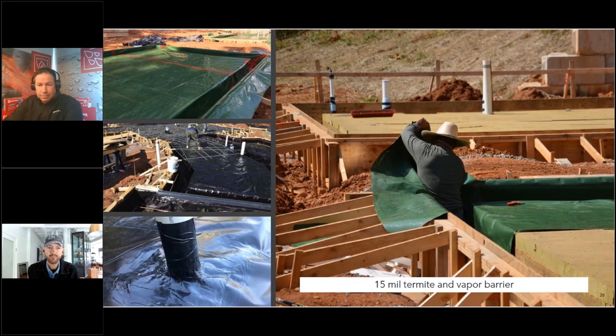After placing the stone wool, you need a vapor barrier in direct contact with the slab. In the off-grid project, they used a 15-mil vapor barrier. In the Marietta project, they used a termite-proof vapor barrier — the black one on the lower left. It has to be taped and sealed perfectly because that's where termites can get in. They also sealed around all penetrations after the slab was poured with liquid flashing, paying close attention to details and following the formwork carefully rather than just laying it down.